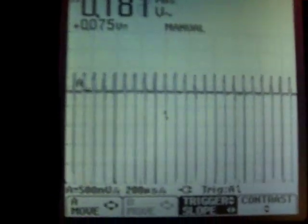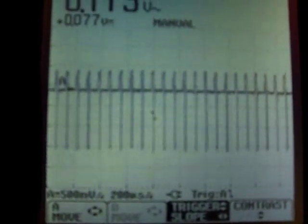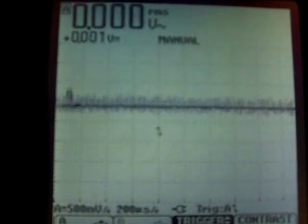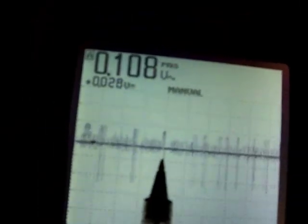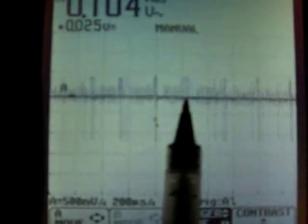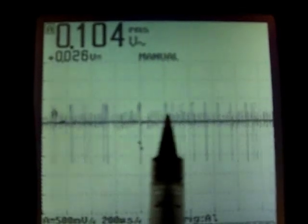You can do it this way and I'd recommend doing it before playing with the oscillation. But as I slowly increase, you can see the negative spike on the shunt is decreasing, and soon I get right to a point — and then there's the full blown oscillation. I just reduce it a little bit. Now you can see that normally where I would have periodic pulses, I have maybe about two so-called ghosting images.